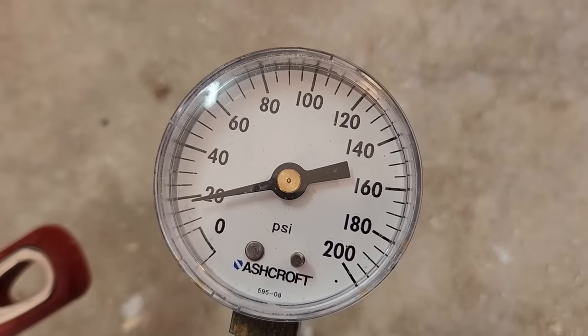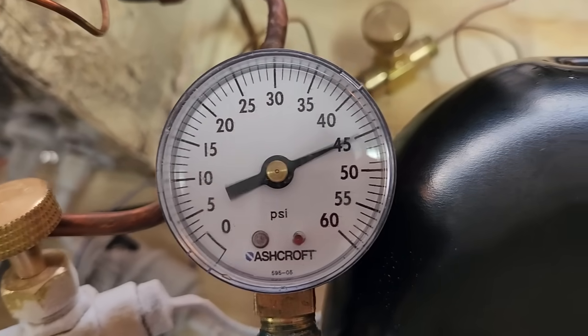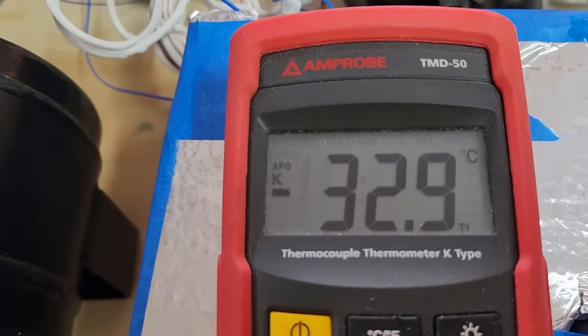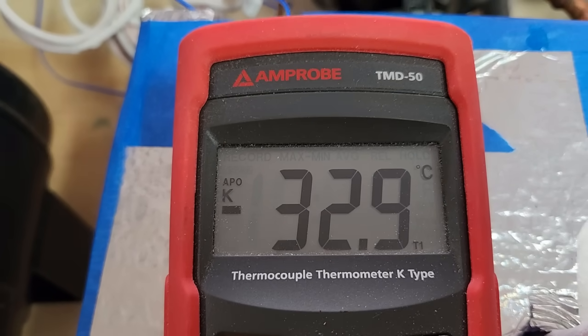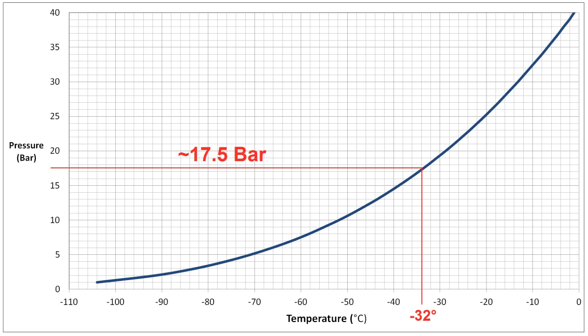I drained my tank down to about 20 psi, which brought my high side beyond the scale of the pressure gauge — at least 420 or so psi — with the low side as high as 45. At this point I was seeing some cooling, but the temperature never went below the evaporator temperature of the first stage, meaning the temperature I was seeing on the second stage evaporator was probably just cold gas that had been chilled by the intercooler but not condensed. This really left me scratching my head. The second stage gas was being cooled to about minus 32C, and at that temperature the ethylene should never have gone beyond about 18 bar, which is 250 psi — but I was well past 400.